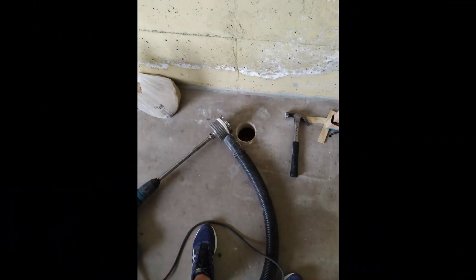My biggest mistake: I had to rent a hammer drill from Home Depot — the drill was about $50 and the bit was another $25 for a 12-hour rental — to drill through five inches of concrete slab. I picked a spot about seven to nine inches from my foundation wall in the corner and started drilling. What I should have done is used a small pilot bit — like a quarter inch — first, to make sure there was nothing below the slab. I ended up hitting a concrete footing or something solid below my slab.